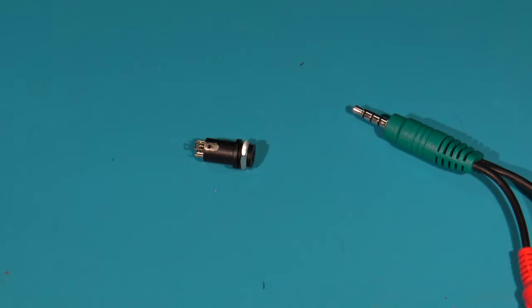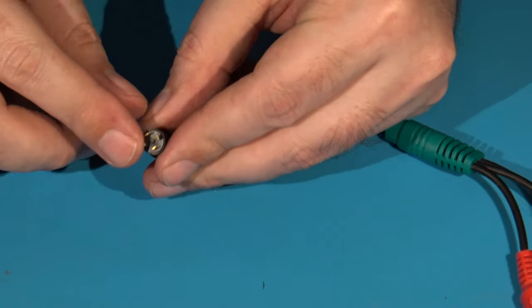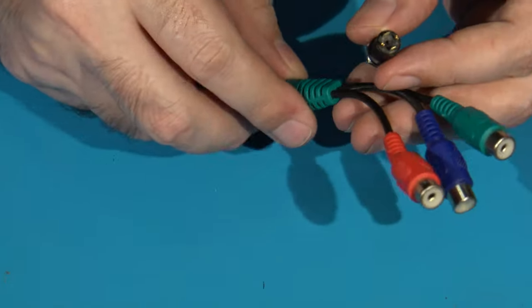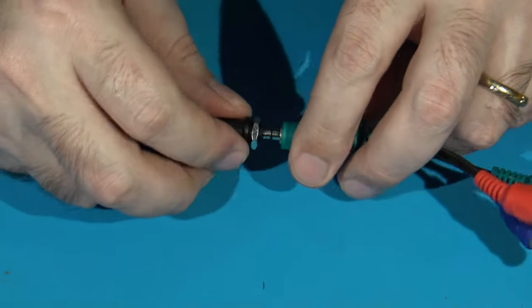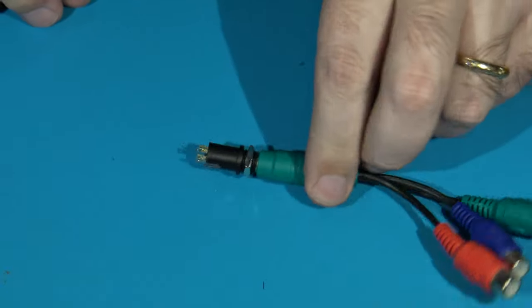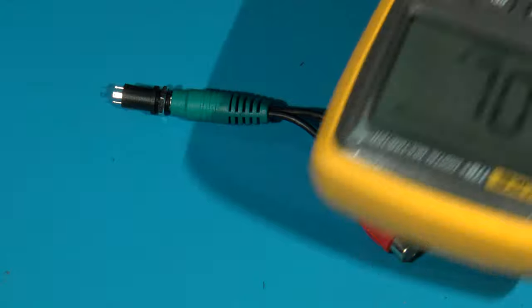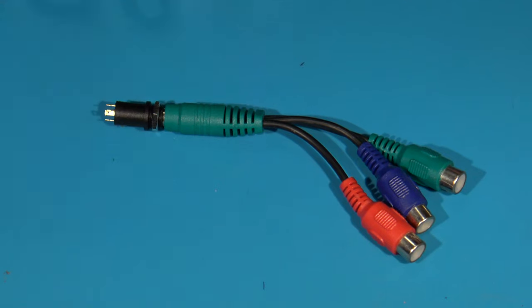One of the other things you're going to need to do is verify which one of the ends off of your little TRRS jack here meets up with whichever cable end here on your breakout. The easiest way to do this is to simply plug it into the jack like this, and then take a multimeter, put it in continuity mode so that it beeps whenever the ends are pushed together, so that you know you have good connectivity. And then you want to just start verifying what's what.